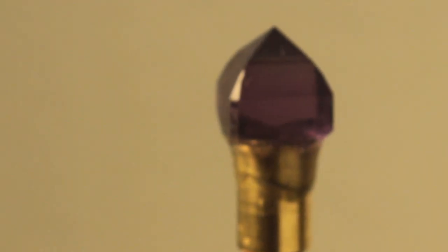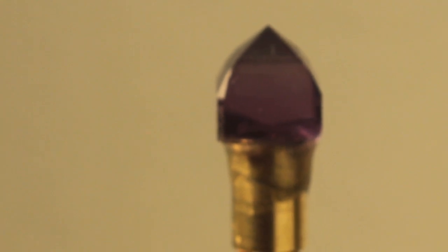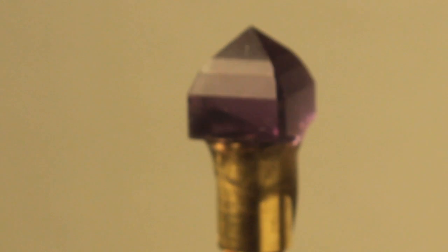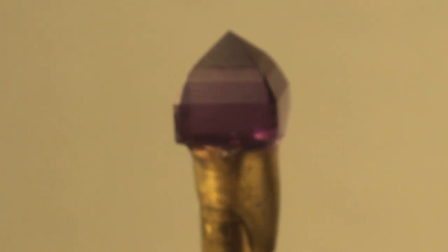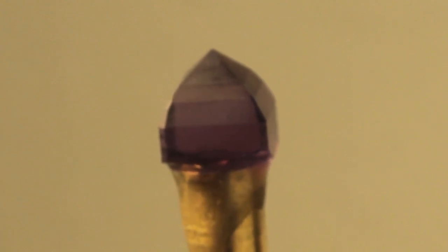So if I was just starting out, I'd buy probably a 260, 220, whatever they are, 360, 320 as a second lap, a 600 topper, unless I could afford a Crystallite lap, and then a 1200 Crystallite, and then I would go to the bat laps, 3,000, 8,000, 14,000. You could probably get by with just the 3,000 initially, and then your polishing laps for most stones. And if I was just starting, I would use the disposable ultra laps.